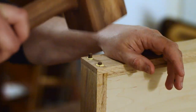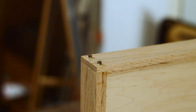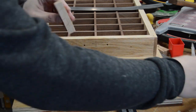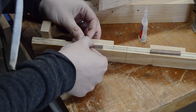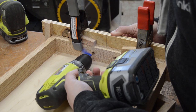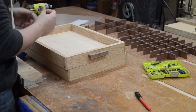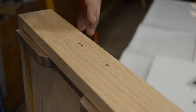After using a mallet to seat the dowels, I tried to remove some of the glue squeeze-out. I totally forgot to put down blue tape before drilling the holes—that would have made cleanup a breeze. After the dowels dried, I trimmed them using the pull saw, but ended up just using the band saw, as that was much faster. I already had the holes drilled in the sides but not in the handles. To hold them in place, I cobbled together a jig using some oak wedges, a scrap of cheap plywood, and some walnut offcuts. It let me hold the handles while I pre-drilled them and screwed them into place. Even with the jig, the angle of the holes could vary, so I marked each handle with a letter and matched each set of holes with the same letter. You can save a step and just mark the letter directly behind where the handles will be attached—I ended up doing this later before finishing.